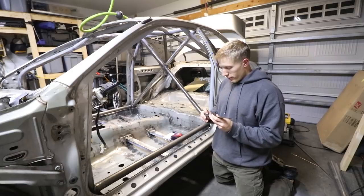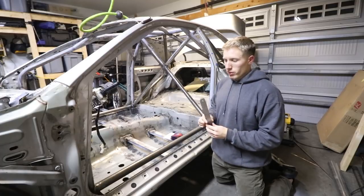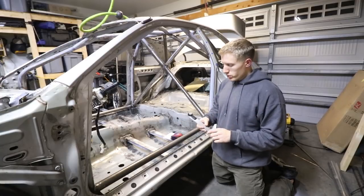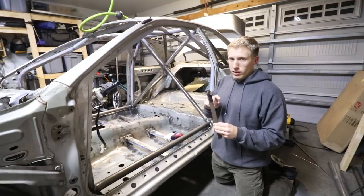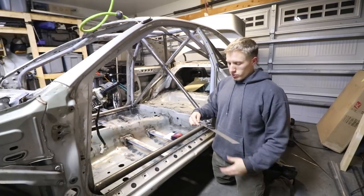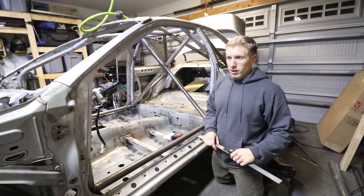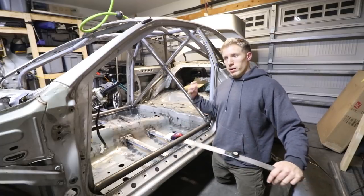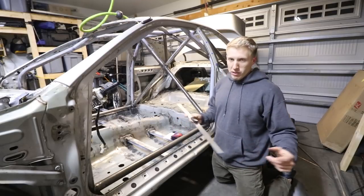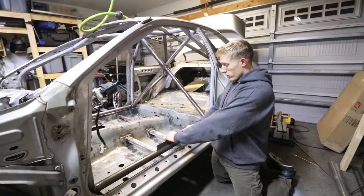This tool is pretty neat — it's just an electric angle finder with two straight edges. You align it to whatever straight edge you want, put it on a flat surface you know is straight, zeroize the angle finder, and then as you slide it, it gives you the degrees you're moving. It's really good for finding weird angles and great for checking the bend while it's still in the bender, because the bender is not perfect. I think it was like 15 bucks on Amazon. There are definitely better ones but this one works pretty good.